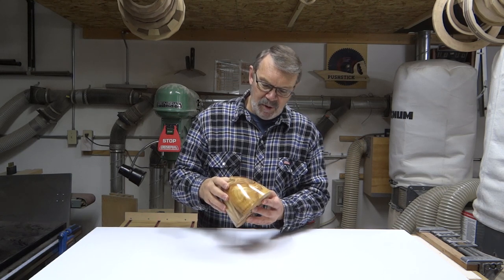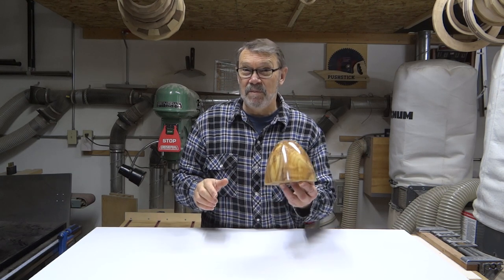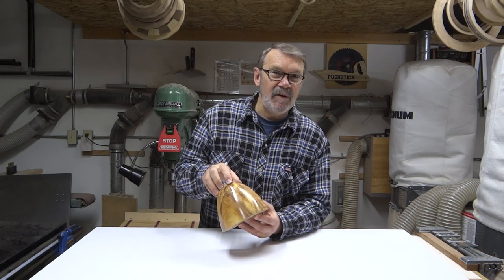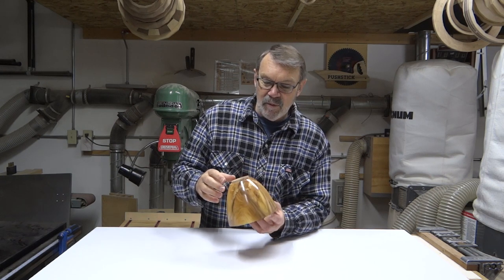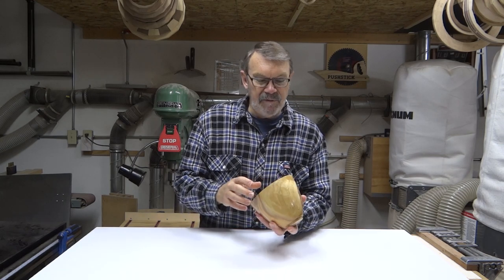Well, I got one coat of wipe-on poly put on here, and forgot to turn the camera on while I was doing it, but it's not like you haven't seen that before and won't see it before the end of this video. Anyway, I think I've got that same problem in there and no idea what's doing it. But I'm going to reverse chuck this now, put the tenon into the chuck, do the interior, and then I will finish the whole thing at once and we'll see how it turns out.